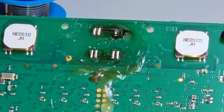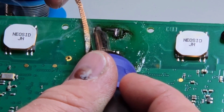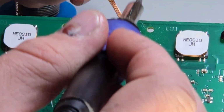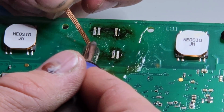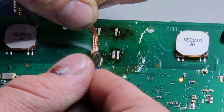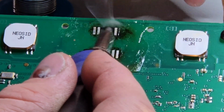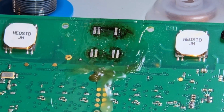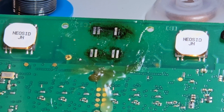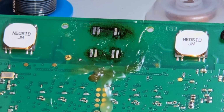now this is a solder wick. Pick up all the old solder. I think I burnt this trace off this one. I think I did. Yeah, I did. Okay. I might turn that down just a bit. We'll probably go to like a... Went down to like 800.